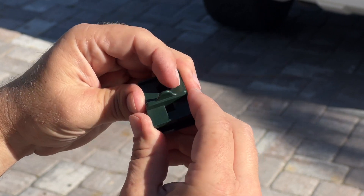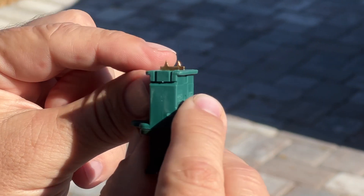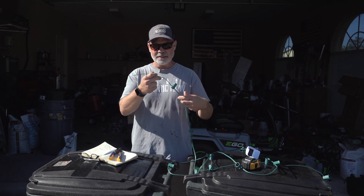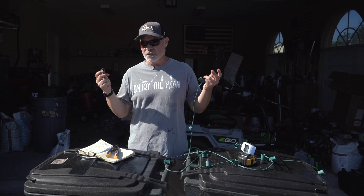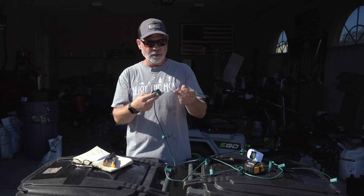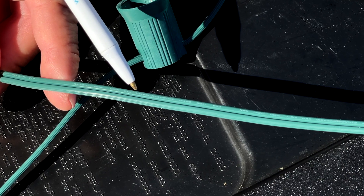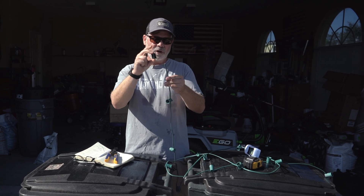When you make your own plugs and plug the male into the female, you'll get leads that pop up — they're offset, one for each wire. The wire we're using is called 18/2, or 18-gauge 2-wire. Each prong goes into one wire. If you were following polarity, you'd have to make sure this lined up all the way through. On this 18-gauge wire, one wire has white writing on it and the other doesn't, so you'd have to keep the same prong going into the same wire each time.